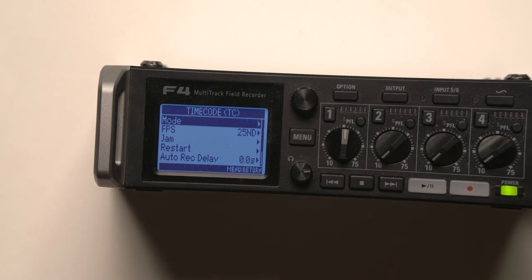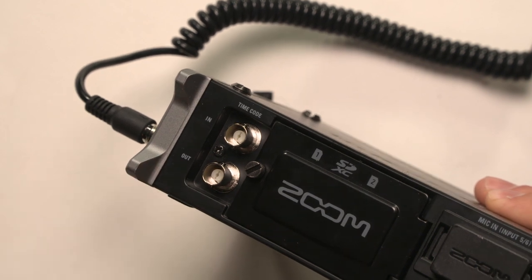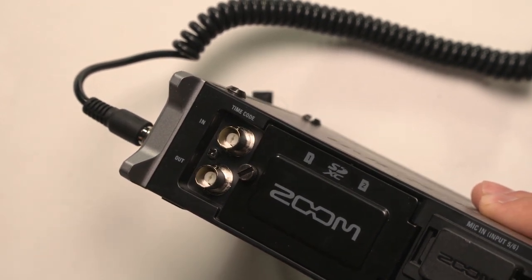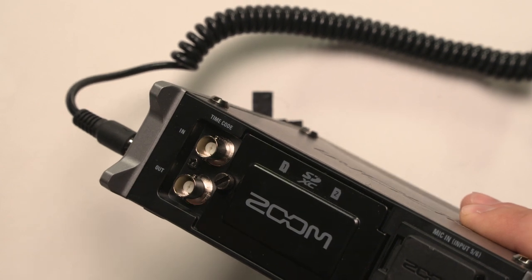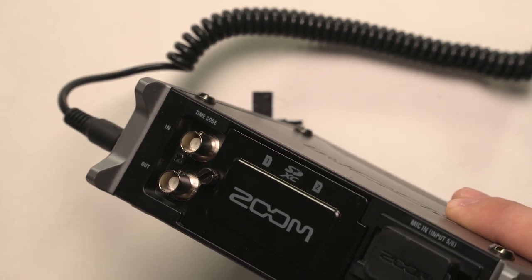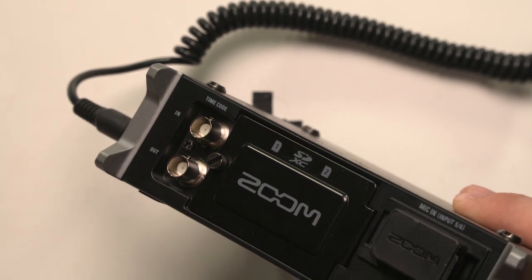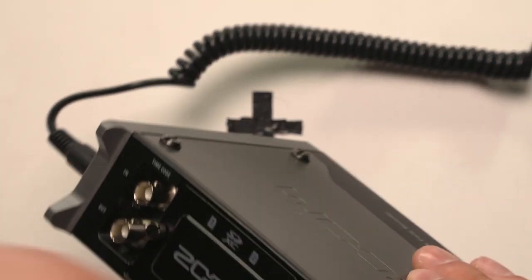You can actually send timecode wirelessly now using Tentacle Sync devices that you can buy online. They're quite expensive, but your camera needs to be able to accept timecode, so the FS7s don't without an external module. But it's just good to generally be aware of timecode. All it is essentially, you send a timecode signal from one device to another. You set one device to generate the timecode and the other devices to slave the timecode, to receive the timecode from the master device. And it just keeps everything locked in. It inserts that information in the metadata. So you have an instantaneous sync across all of your audio and video content. But you need to have a device that receives timecode, and you use a BNC type HD-SDI cable to send and receive it.